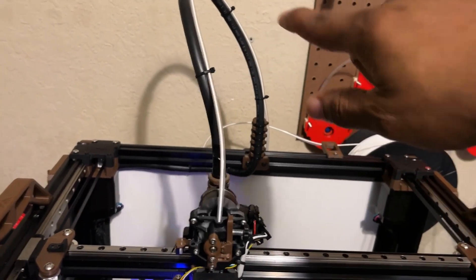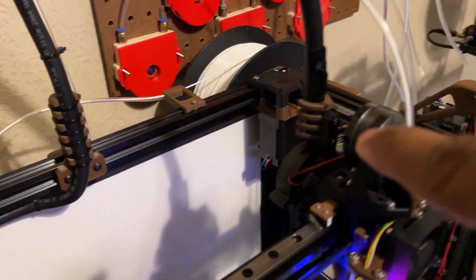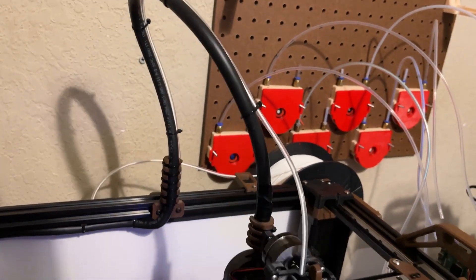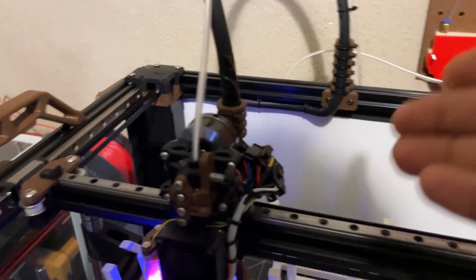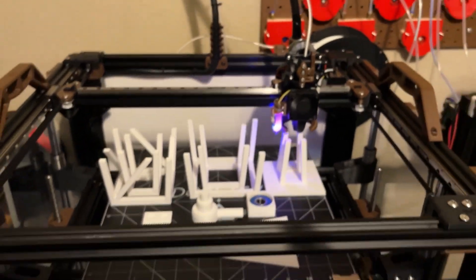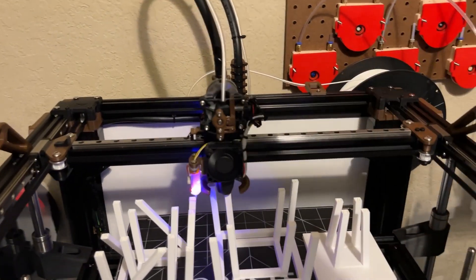As you can see, the cable stays upright. I put enough zip ties to keep it in place. It is a little stiff because it's 20-gauge wire by 20 — 20 conductors inside — which allows for enough expansion. If I wanted to add an LED light or permanently mount an accelerometer, I could. I've zip-tied the extra set of wires up there, so if I need to expand to the toolhead down the road — say they release an EVA 2.5 carriage with LEDs — I have enough wire without tearing down the printer.